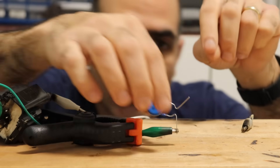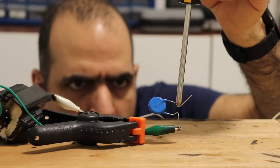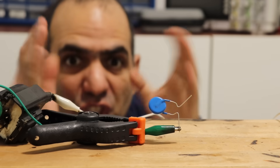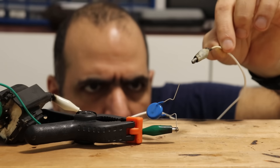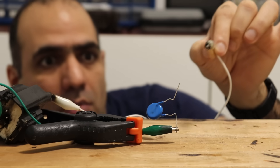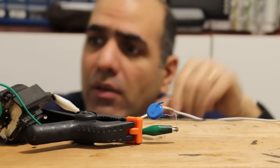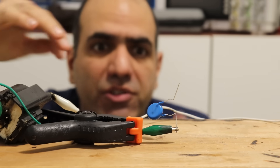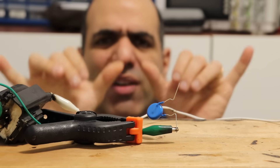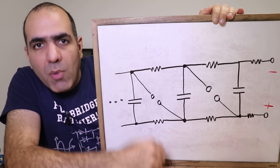Let me turn off the supply first. Capacitors hold charge and can shock you badly. Make sure to discharge them before you touch them. Here's a wider gap. It seems like the voltage is now above the 15,000 volt rating of the capacitor and just jumps directly between the legs. I might have to put two of them in series then. Anyway, Marx generator uses the same concept — quite a simple but smart voltage multiplier.